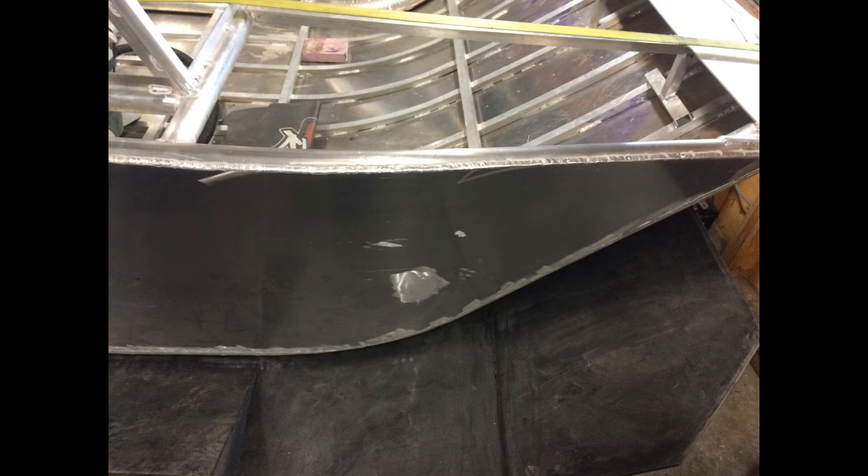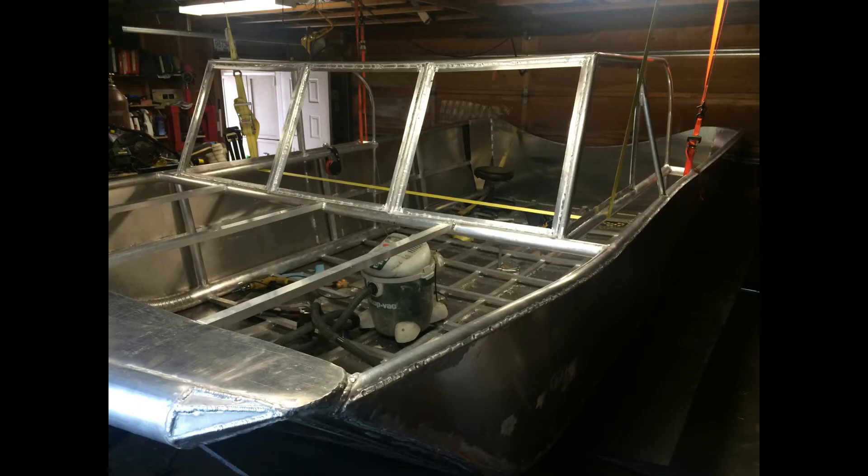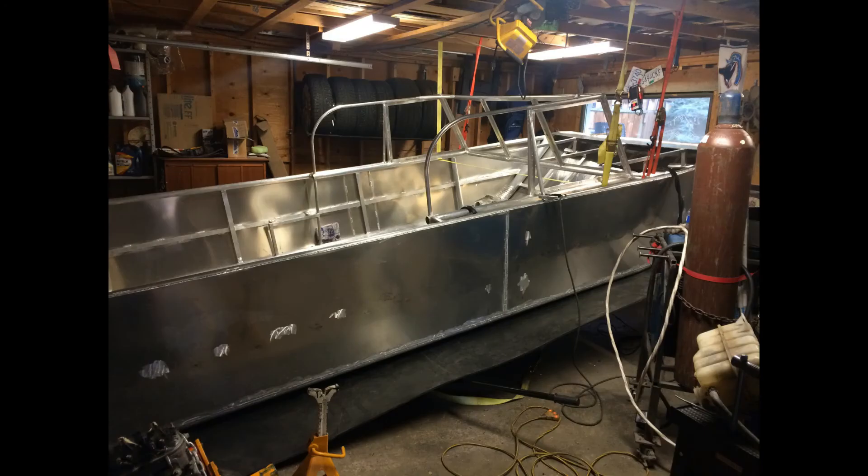Since I was doing this in my garage over the winter, I had to keep the garage quite warm. I used heaters to make sure the poly was warm enough to be pliable. But we had a really nice result — the entire bottom of the poly was completely smooth, no wrinkles, no areas of separation. Everything was completely flat to the hull.